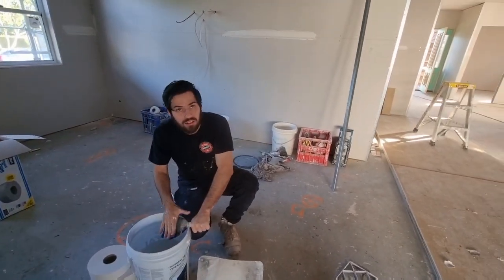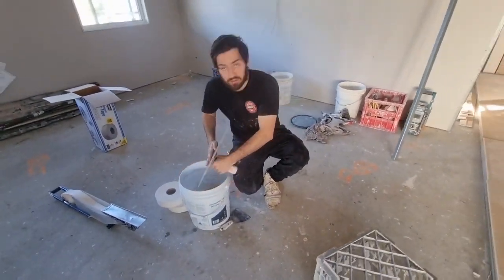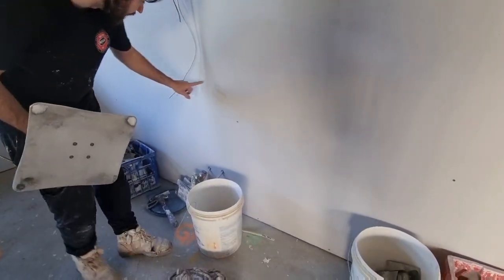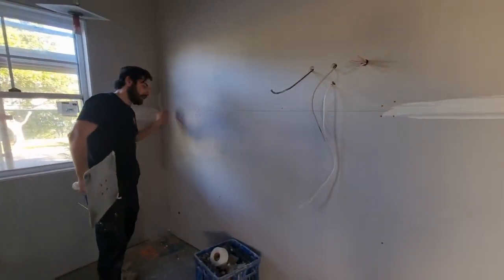If every sheet started from the left — next year they'll do that. They're doing less and less. With the little screw bits, they'll put things like what you said — they call it a DIY board, they already do it. Sometimes they have these little fancy lines. See these lines? They're the exact section of the ceiling that you're meant to screw. So you glue here, screw here, glue in the center. It's hard to see, but when you're doing ceilings it's a lot easier because the pattern's different to the walls. It's handy because if you can find them, every single one's exactly on that spot — unless you put the sheet in wrong. Because the buttons go this way, it's always going to be in the right spot.